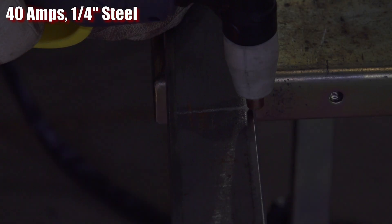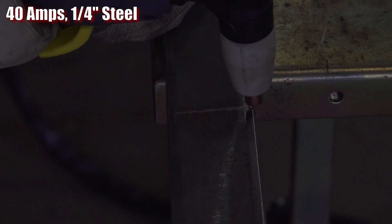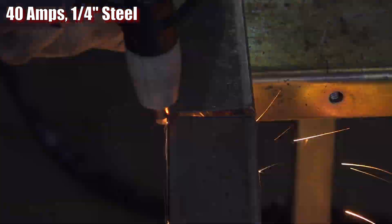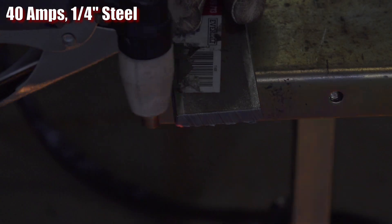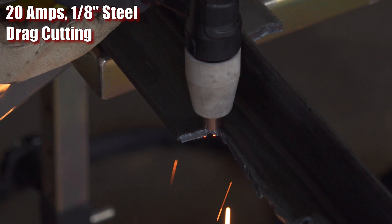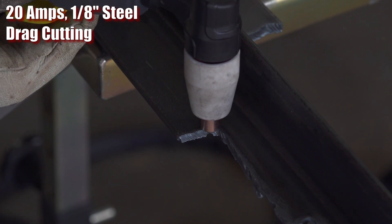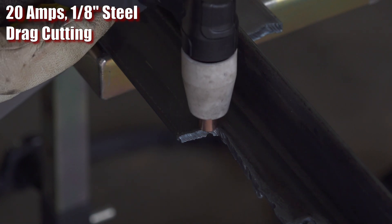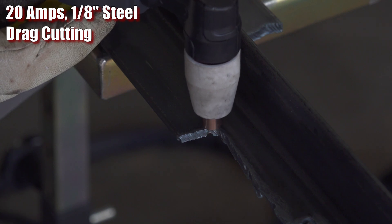When running on 120 volts, it maxes out at 30 amps, so even when maxed out it will occasionally take multiple tries to get an arc going. Once it gets going, it actually cuts okay and easily cuts through 3/16-inch steel. Unfortunately, on 120 volts it pulls 45 to 50 amps from the wall when maxed out, so you may find yourself tripping a breaker if you make anything other than very short cuts. I was able to make short 2 to 3 inch cuts using my dedicated 20-amp circuit in my garage without tripping the breaker, but a cut lasting much longer than a few seconds will probably trip it.